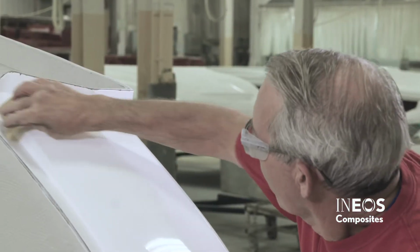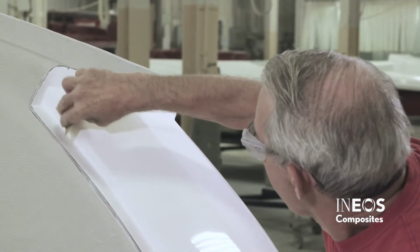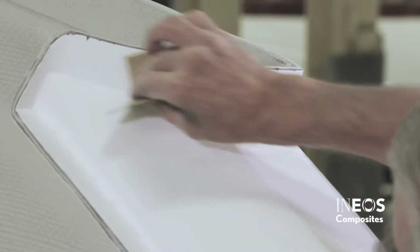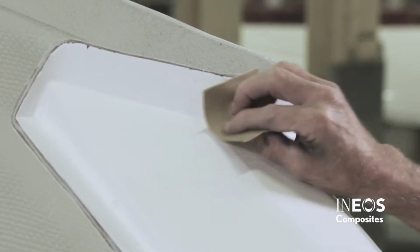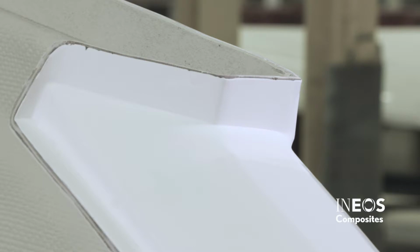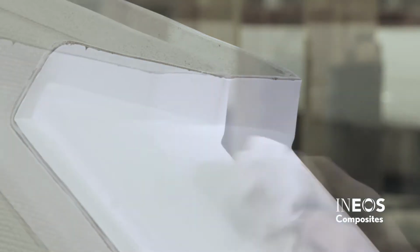Clean and check the sanded area for shiny spots that show through the scratches. Shiny spots indicate that the sanding is not complete. Continue to sand the area until the surface is completely dull. A clean, even sanding will result in an excellent mechanical bond and will reduce the risk of a halo.